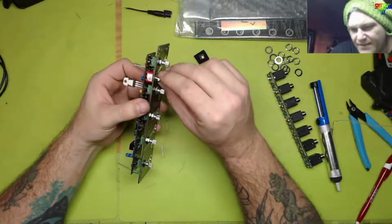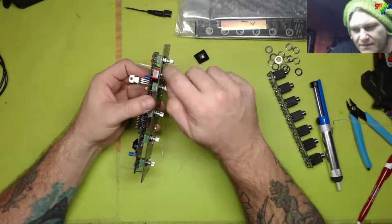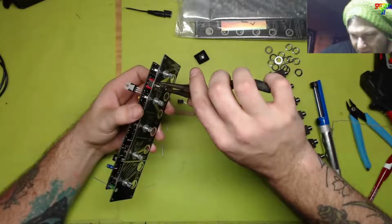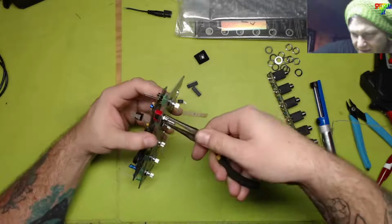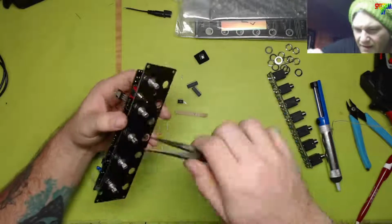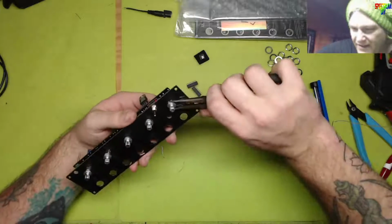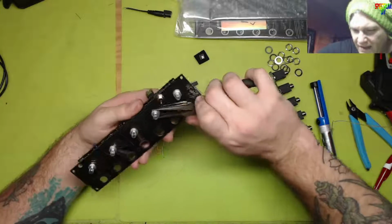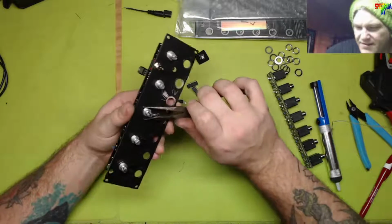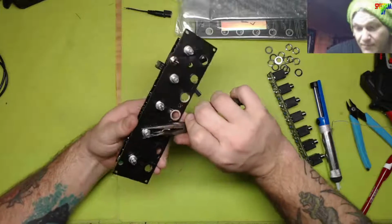But again, I'm not soldering the switch in. It's supposed to be momentary, and I did order those momentaries. They've already shipped that fast. So for the time being, for the sake of being able to trigger it using the switch, we'll use the momentary when it gets here, and in the meantime use this one. And then if this voltage regulator for some reason is critical and will not work without the smaller one, it's only barely soldered in and it's got a really good mechanical hold, so we could just desolder just the tip and replace it with the ones that are on the way.